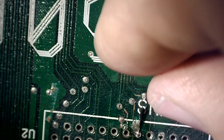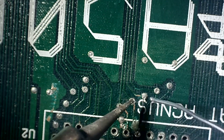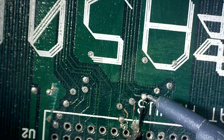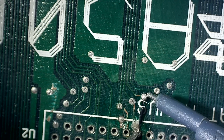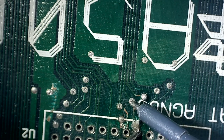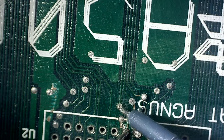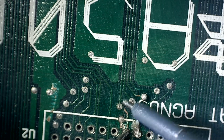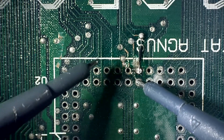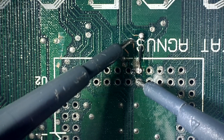I started putting these links on the top and then realized it probably makes more sense to do it underneath - put the chip in first. So even though they're here, these get removed and I put them on the bottom side of the board. Again, another completely dead track there - these two were fairly easy to sort.